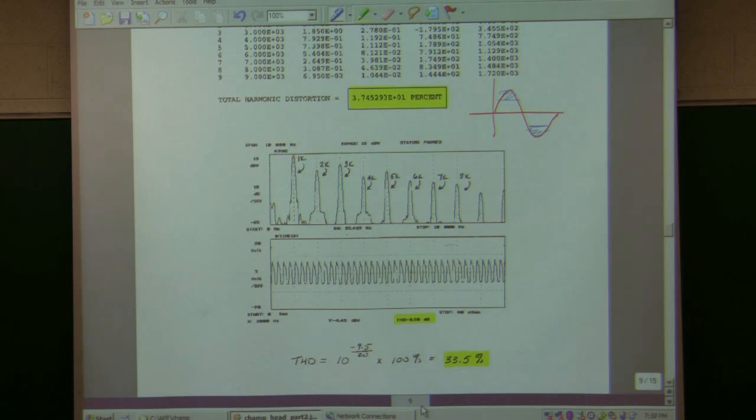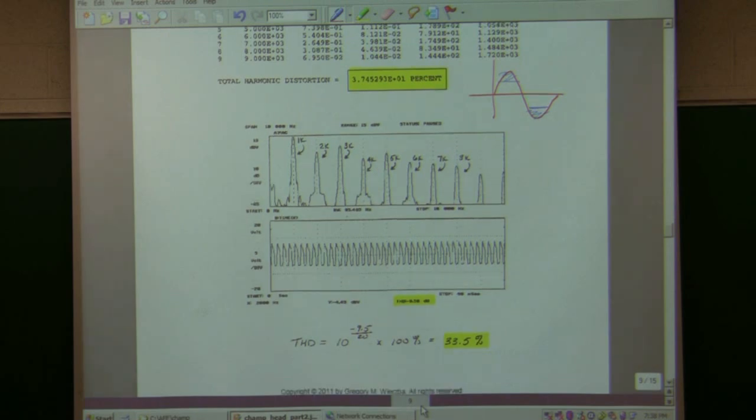And I didn't include the mutual inductance for the transformer, for those who know what that is, and the losses in the coils. And I got a result that was pretty close, but when I included that, it almost was identical. Because I had that model pretty tight. I measured all the components in that Tweed that's in that box. This one here, I had measured everything, and when I wrote this up, I was doing pretty close modeling, but